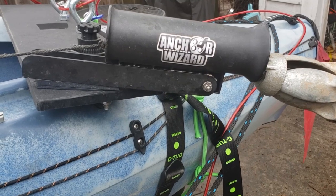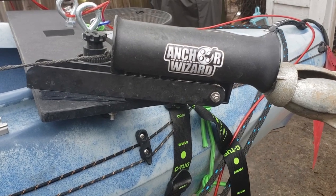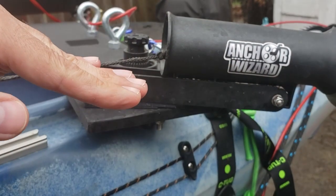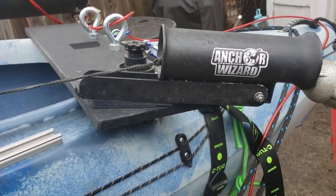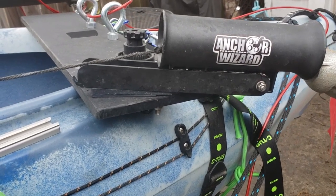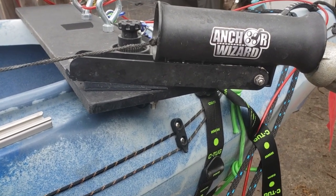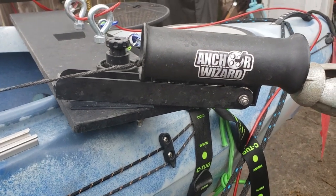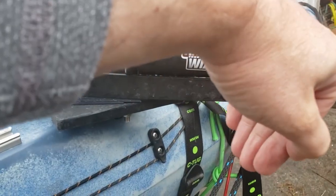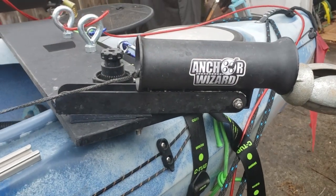This is an update to my prior video — I've done an additional modification and want to show you real quick. I've essentially wanted to create a slight angle of decline on the anchor wizard chute, just to allow the anchor wizard to deploy a little more freely so it's always at a downward angle. As soon as you release the handle for the anchor wizard and start introducing play in the line, it just wants to shoot straight down. I've also found it makes it a little bit easier — when the chute is back and down in that vertical position, this allows it to pull up and get on that angle better, making a smoother release.